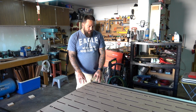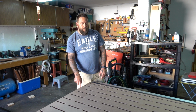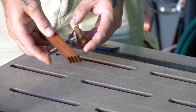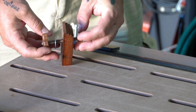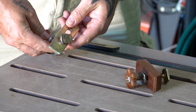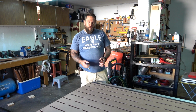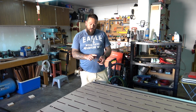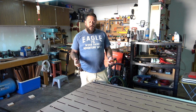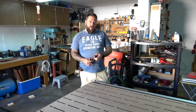Now the whole idea when making this spoil board was that I still wanted to be able to use the T-slots that are in the actual table. Quite a while before I even made this spoil board, I made a bunch of these hold down clamps which made use of these T-bolts that came with the machine. Along with these T-bolts, there were also these metal hold down clamps, but the reason I went ahead and made the wooden ones was in case my tool path wasn't exact, I didn't want my tool to run into this metal hold down clamp, which would obviously ruin the tool, whereas having the tool run into a wooden hold down clamp, I would most probably ruin the clamp, but I would hopefully not ruin the tool. And so far that has definitely proved to be helpful. I have run into these wooden hold down clamps a couple of times, and I'm pretty sure I've saved a couple of tools that way.